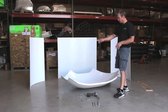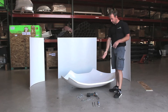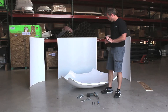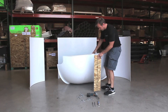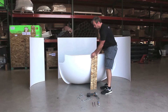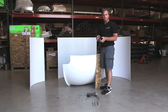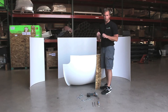We've got the corner piece down here, a four-foot 2.5 module to go on either side of it, and then this piece goes on top of the corner. This will take about three people since the system has no legs and nothing is self-supporting. We're going to lift this up, support it here — we've cut this to 32 inches as a support — then get in here and join the flanges behind the modules together with the nuts, bolts, and screws from the H4 hardware packet. We'll do finger-tight first.